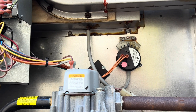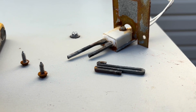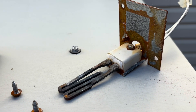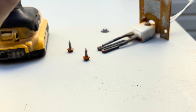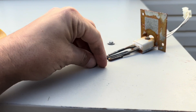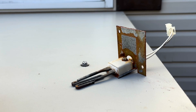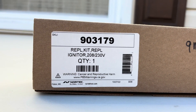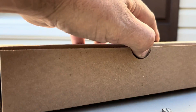That's weird. All right, let's put a new igniter in her — there she is. These go bad quite often, but this is an absurd amount of igniters this thing's been through. This is at least the fifth one I've done in the past five or six years on this one. This unit is 208/230 volt, so you can't just throw any old igniter in her.